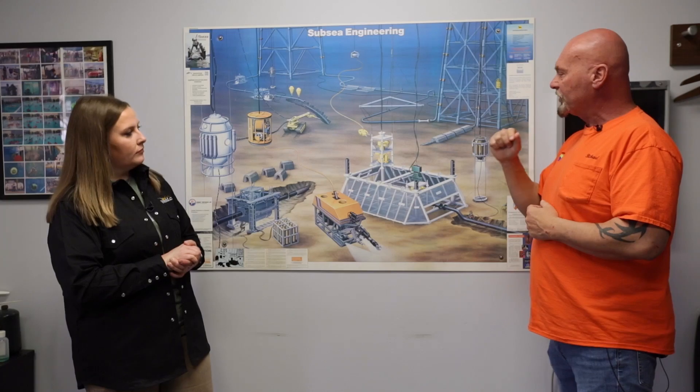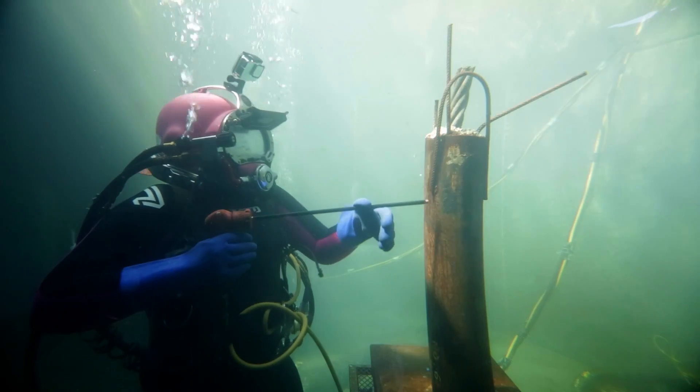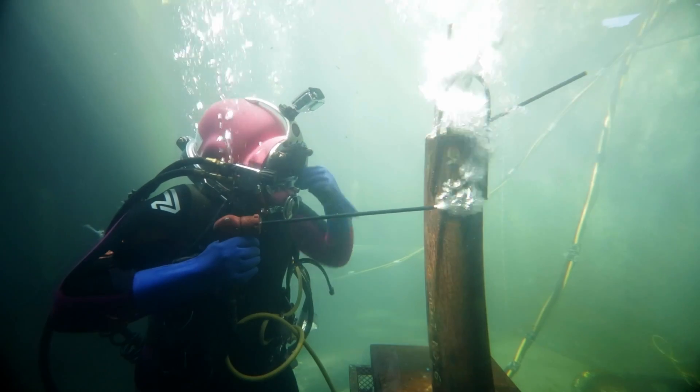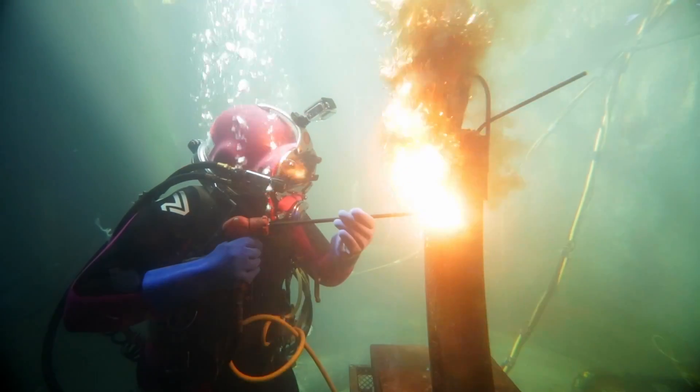You've also got your nuts-and-bolts construction and your underwater burning. We use an exothermic rod hooked to a welding machine. When you're down there ready to cut something, you get it hot just like you're welding — they turn it on, you hit your trigger, oxygen goes through, and it lights. These things heat up to about 10,000 degrees and they can cut through barnacles, iron, sharks, whatever.